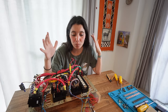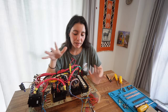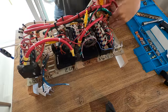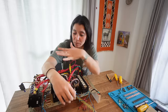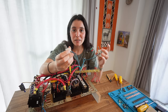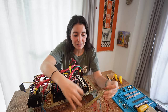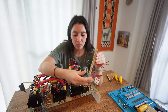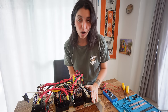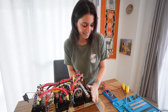At first it was super difficult to have it all planned out in our heads because we didn't know how this was going to unfold. But now that we've started I can already figure out the next steps. What I did was remove these parts here, which are the back lights of the writing on each button, because all I need to replace on the whole panel is just the lights — only the lights are 12 volts, all the rest is fine. This strip here is the light itself of each button; this is the old one and it's going to be replaced by a 24-volt one. These here are all off so I'm going to turn them on and test.